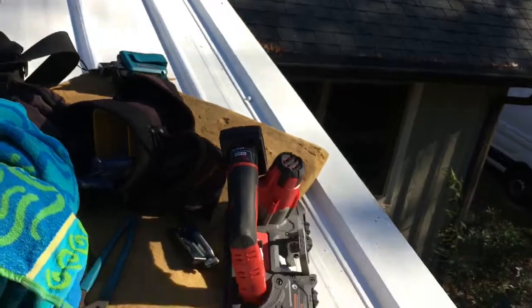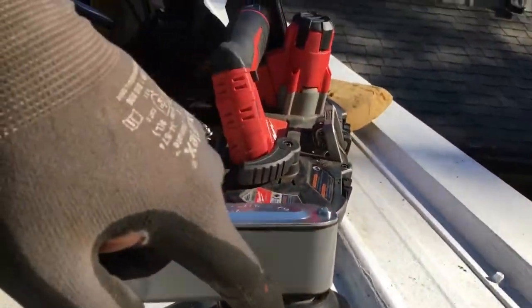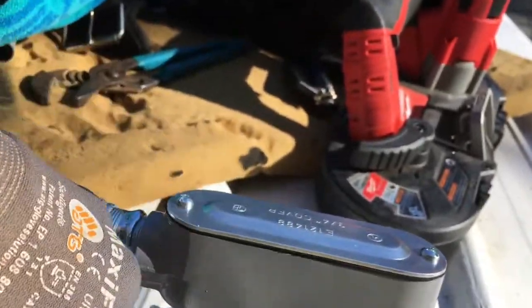Johnny Valentine here doing a quick roof penetration. First step: cut your roof boot the right size, get it tight in the up position so that it's going to shed water.